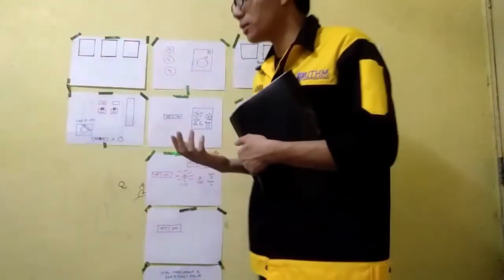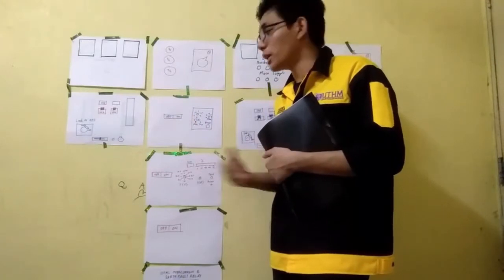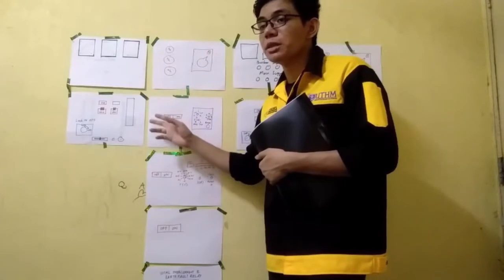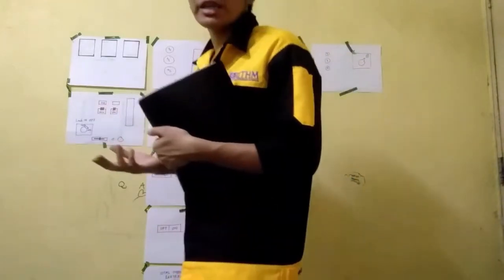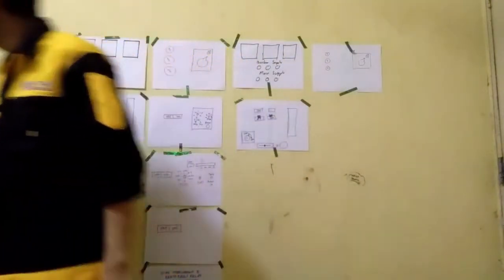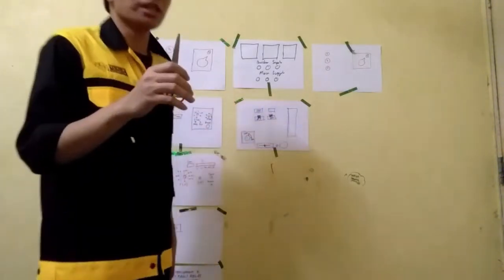As we have cut off the power supply from the TNB, we can take out the air circuit breaker for maintenance purposes on the ACB. In order for us to take out the ACB from the MSB1, we need to use the charging handler to remove it. How do we do it? First we must find the handler. Imagine this is a handler.